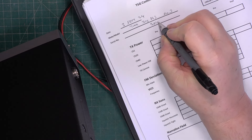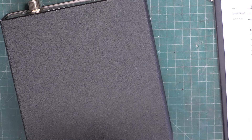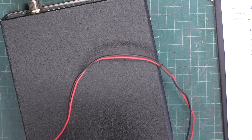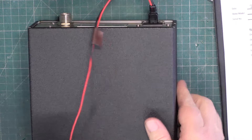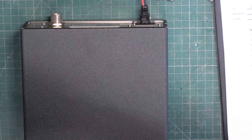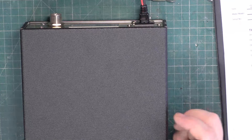We'll make a start on this — I have 15 minutes. There was a comment on power leads. This is the standard power lead we're using, which is the one originally provided with such radios from Cybernet. It's been noted that when I go into transmit on the on-the-air test there's a bit of light dimming. Bear in mind that whatever the power drop is, I'm tuning it including that power drop. The problem could be that if somebody found a heavier-duty one and there wasn't a power drop, the radios we're tuning could be slightly overpowered. But that's the one supplied, that's the one we're using.